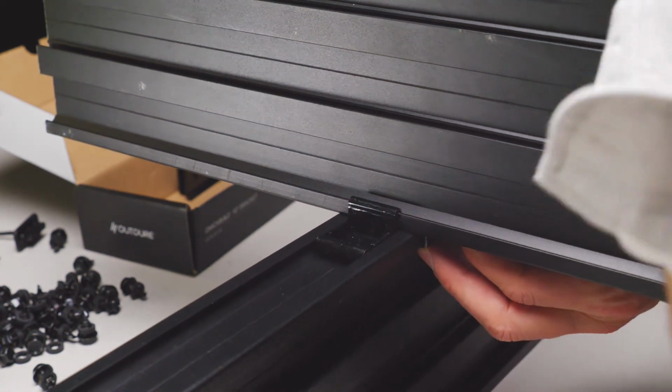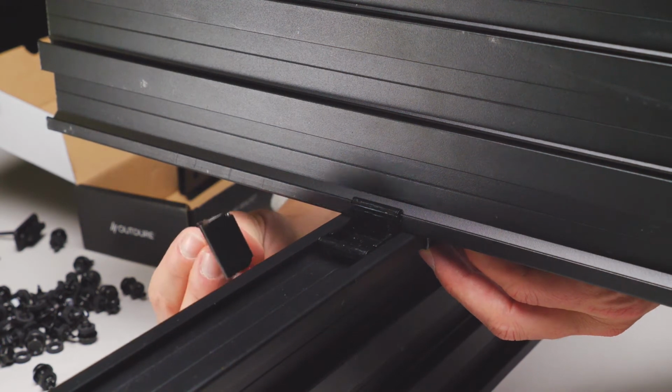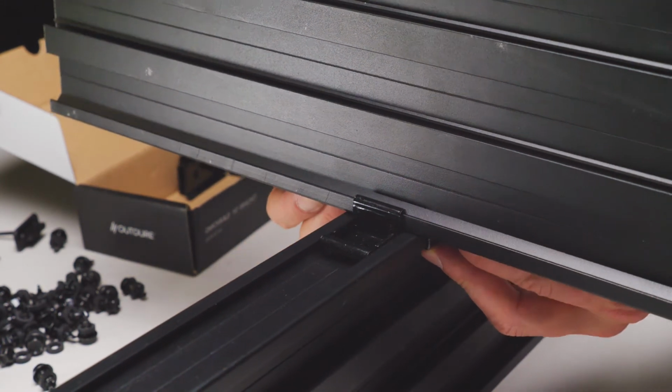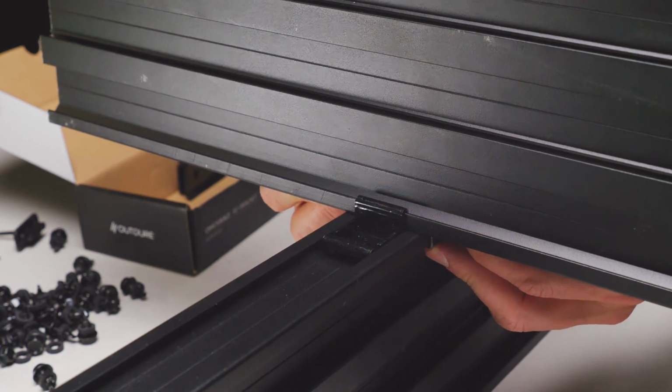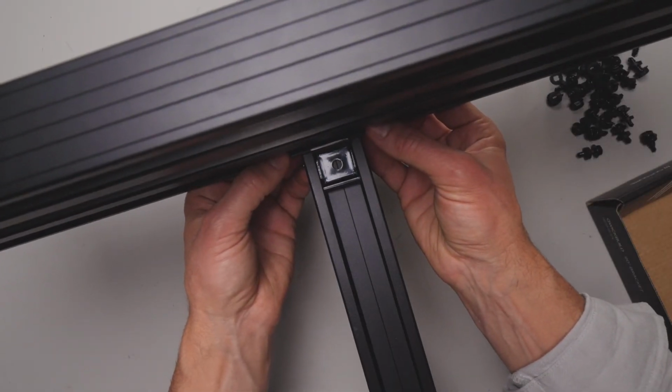And you may need to, depending on if you're using the even larger profiles, hook one underneath here. So now you are really locking that joist down onto that bearer because you've got 4 joist anchors holding it in place. So you can see there.